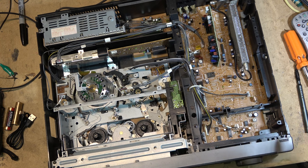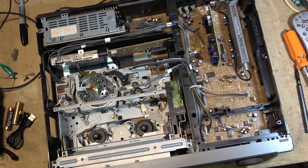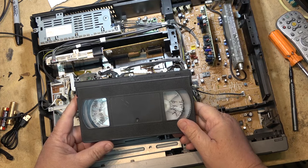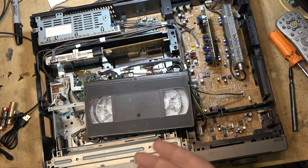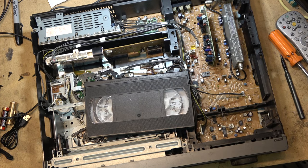For starters you need a tape that you know is accurate - one made on a machine that is properly aligned - because obviously if you make a recording on a misaligned machine you will be correcting the alignment to a misaligned tape. One way is to buy a commercial alignment tape - good luck finding those these days. They used to run well north of a hundred dollars, most around $150, and we're talking 40 years ago. Today finding a brand new commercial tape would be a real challenge.